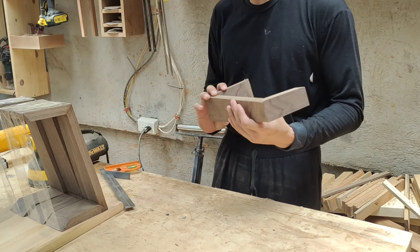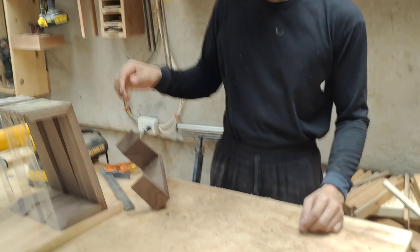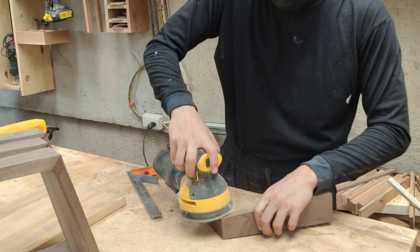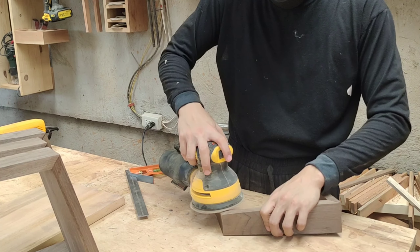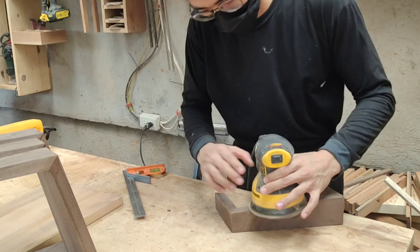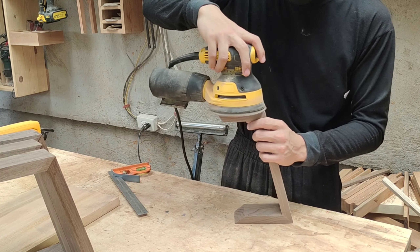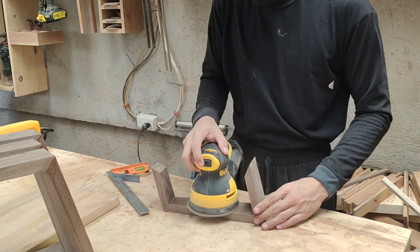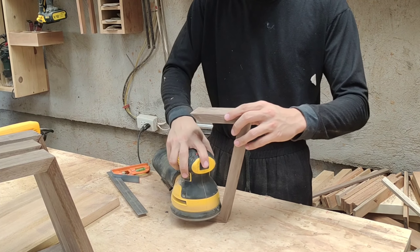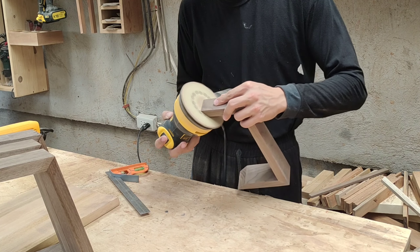A little more just to check — yeah, see, it's tough! Our next favorite step is sanding. Who doesn't love sanding? I hate sanding. Quick rundown: I start with 120 grit to remove excess material and rough spots, jump to 180 to remove the marks left by the 120 grit, and finally 400 to smooth things out. I lost the clip where I was applying finish, but I applied boiled linseed oil — a natural oil to let the natural colors of the walnut shine.